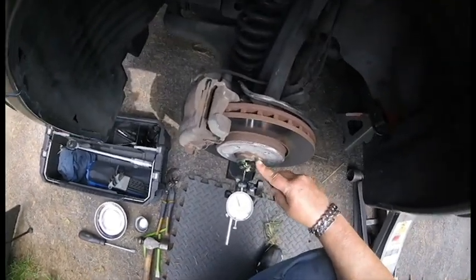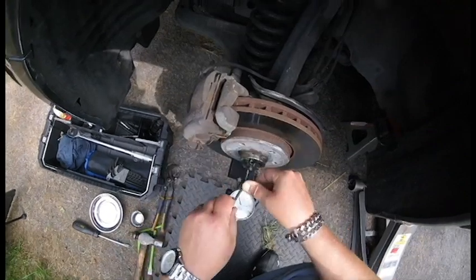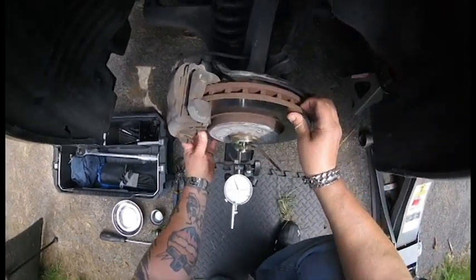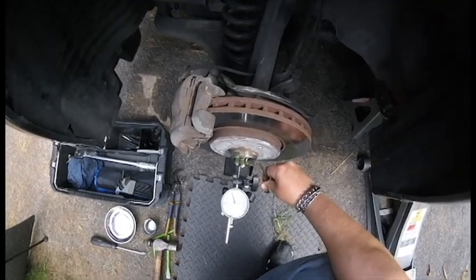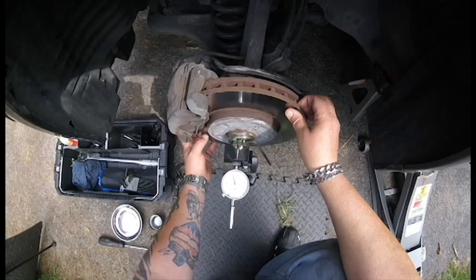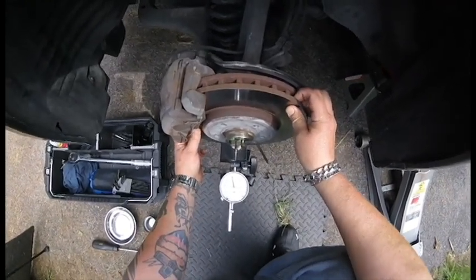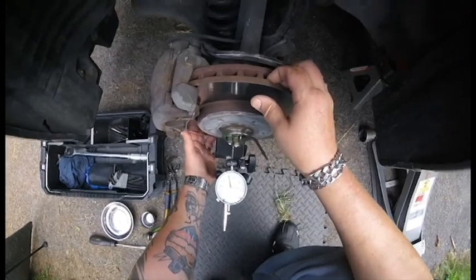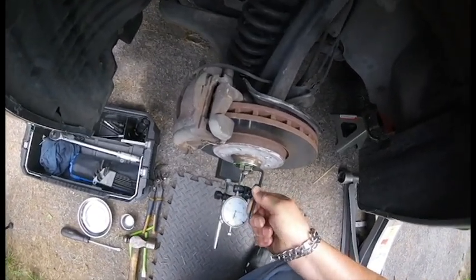That's too much. So I got a five millimeter Allen on here — I'll loosen this up. Let's see what it reads again. It's about two thousandths. That looks good to me right there. I got a little bit under a thousandth of an inch. I'd rather have a little bit of play than not enough in there.